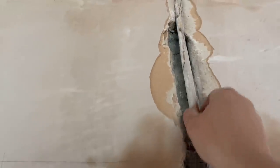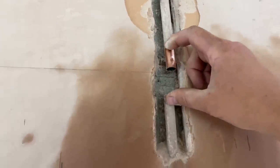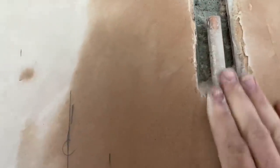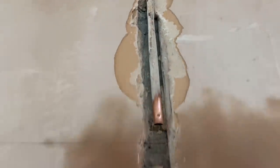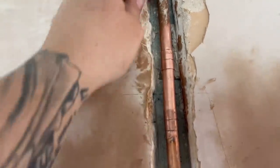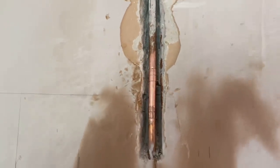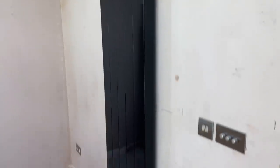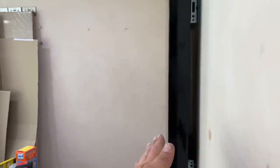So what I've managed to do is cut out where I drilled the hole and fortunately we've got enough movement on that pipe under the floor - cut another section in there, lift that up, slide a coupler onto it and get it back in the wall. The pipes aren't buried that deep in the wall. So I managed to cut that section out, move that pipe up, get that little section in there, pull it down, get that soldered up. For this other rad on this wall, we've got a bit of an issue - the middle brackets - we don't know if the wall's out of plumb or the rad is, so we're going to lose the middle brackets but the top and bottom are holding it firm.